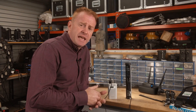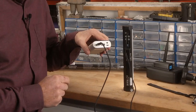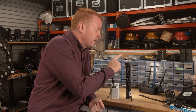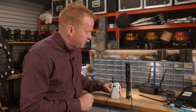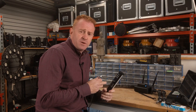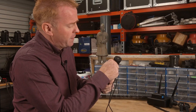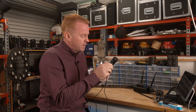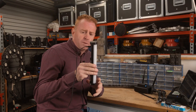The unit has a built-in battery that can run the light at full power for 1 hour and 10 minutes. If you want to extend battery life, you can simply use a USB battery pack — but here's the catch. A cheap USB battery pack typically outputs only 1 amp, giving you 5 watts, and the light at full power draws 6 watts. If you get a decent battery pack that outputs 2.4 amps, you can run the light at full power and simultaneously charge the battery. Unfortunately, they put the USB port on the back, which means if you want to put it on a table lighting upwards or mount it to a wall, the cable gets in the way.